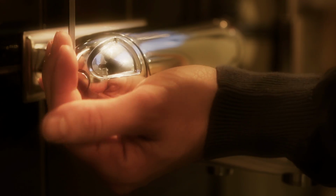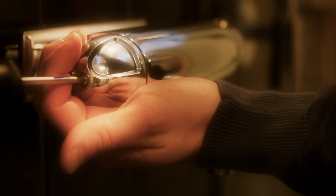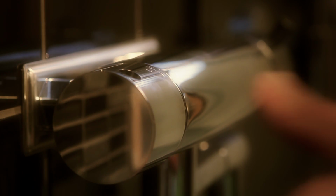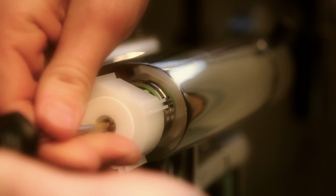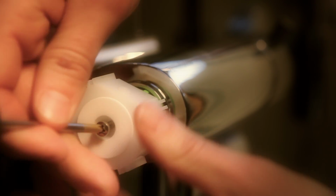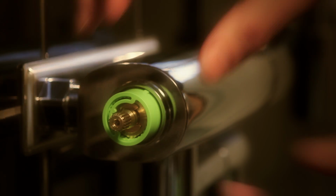The cover in the 9000 series is much smaller. Remove it using a small screwdriver and then unscrew and remove the knob. The on-off knob on the Garda series is removed by first pulling out the lever fitted to the knob. If it's stuck hard, wrap a wet towel around it and draw it outwards with a polygrip wrench. Unscrew the Phillips screw on the side of the white inner sleeve. Pull out the sleeve and the green echo flow ring.